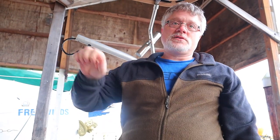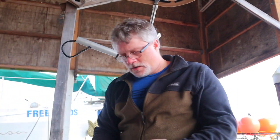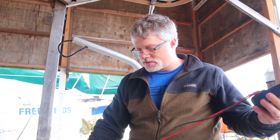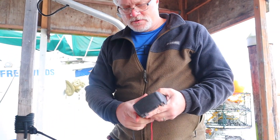The other thing is, the other side of the plug is still an L630 twist lock, so it's still subject to the same issues of twisting and stuff, but at least it solves one side of the cable. So what's the purpose of the smart plug, in case other people don't understand what a smart plug is, other than me? It's supposed to reduce heat. Heat's what causes fires, causes electrical degradation. Nothing good comes from heat, generally.